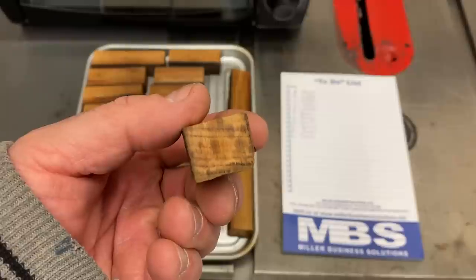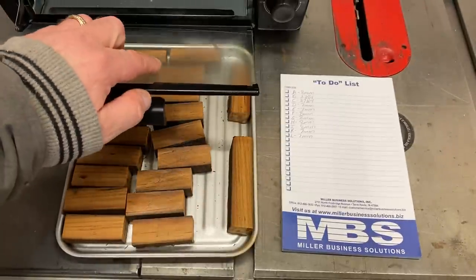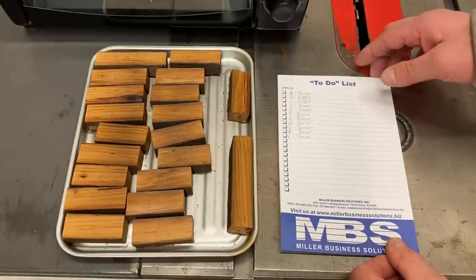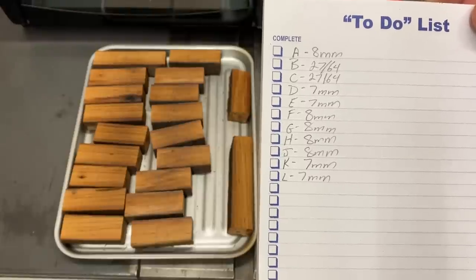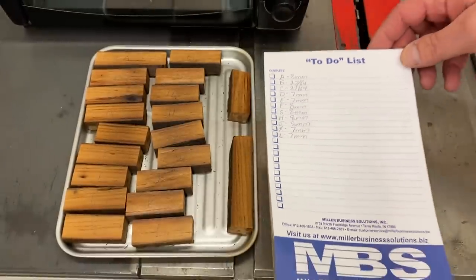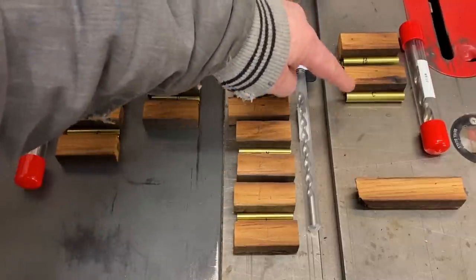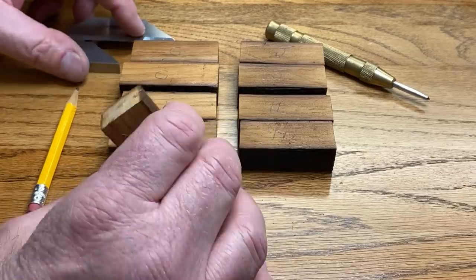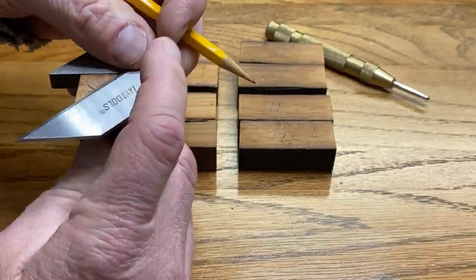The little marks on the ends I initially thought were moisture marks are more resin than anything — if you look at the door of my oven you can see a haze on it that wasn't there when I started, and it's a little bit tacky to the touch. I went through all of the pen kits and made a note of what size drill bit they use. I'm going to group the tubes with their blanks into groups of 8-millimeter, 7-millimeter, and 27-64-inch blanks so that we can begin the drilling process. These two columns are the 8-millimeter blanks, these are the 7-millimeters, this is the 27-64-inch, and this one spare blank is in case we need to do a repair. We need to find the center of each blank and mark it so we can drill properly down the center.